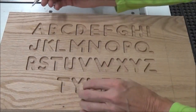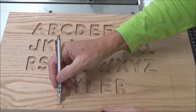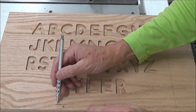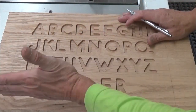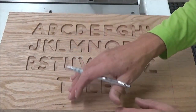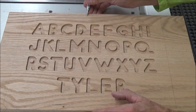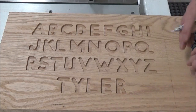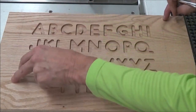I decided on about an inch and a quarter reveal all the way around. The reason is that where this nail hole is, I can eliminate it. But there's a crack right here, and it's going to be right on that cut line — hopefully when I make that cut, I won't have any defects on this side of the line. I've got my line up here where I need to cut, so I'll trim that back. Here's the cut on the right side and here's the cut on the left side.